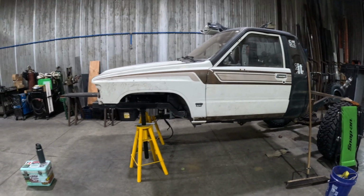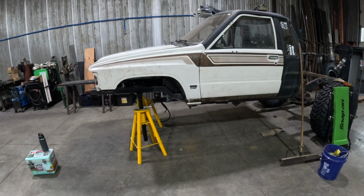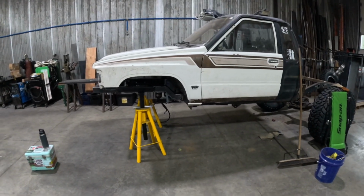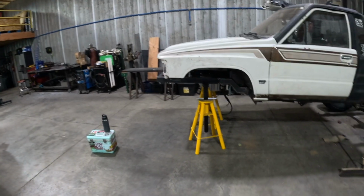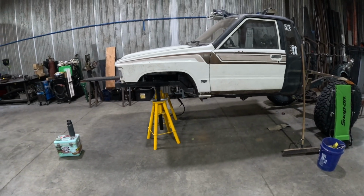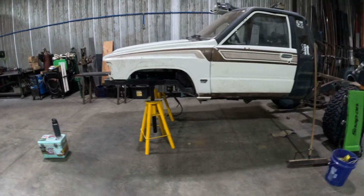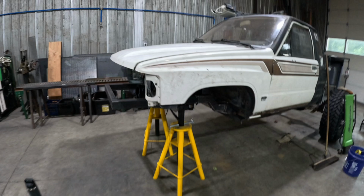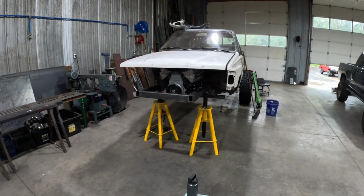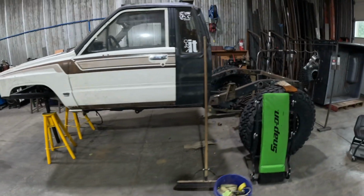Still waiting on axle shaft, so we can't do anything with the front axle yet. So I think we're going to steer towards getting the engine fired up, and getting that all plumbed. I'm still waiting for my Magnum box to ship, so we can't really do anything on T-case. Oh, and the torque converter didn't fit the new J&W bell housing. 13-inch stock converter does not fit. So, waiting on a torque converter too. It's getting out of hand. But that's okay. We're in the shit now. Nothing we can do about it but keep forging ahead.